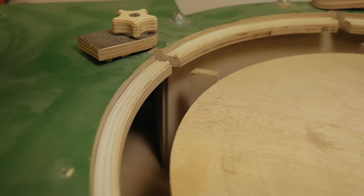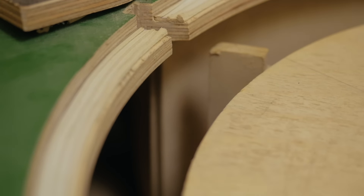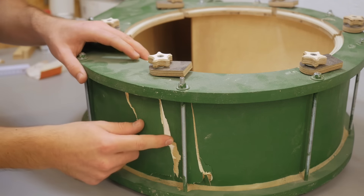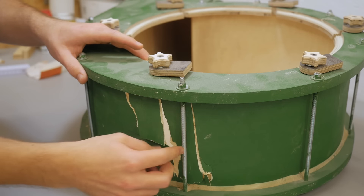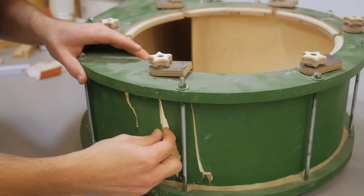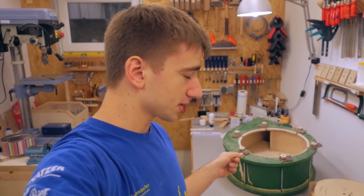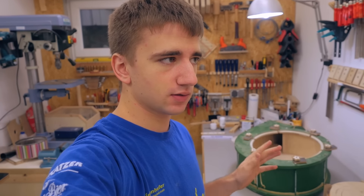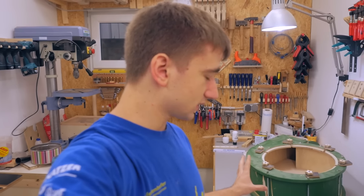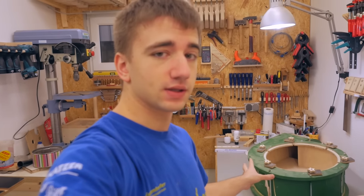It's still loud, but a more comfortable loud. The biggest reason for the loud noise was the fact that the fins were too close to the blower wall. The really good thing about this blower housing was that it was strong enough to keep everything of the impeller inside when it blew up. This was four millimeter plywood, but even though this design works I probably won't use it again because the new impeller will be a little bit bigger, so I'll rather use steel or aluminum for the blower wall this time.